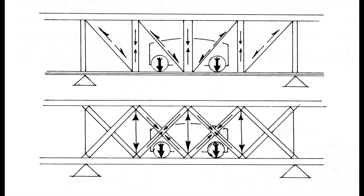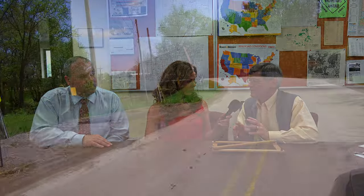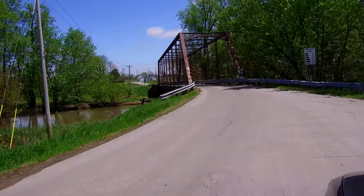Any truss has two types of forces that act on it: forces that are pushed together, said to be in compression, and forces that pull apart, said to be in tension. In a drawing you can actually understand what components work in a truss. The arrangement of the tension members and the compression members is what defines a particular type of truss. In an iron truss, the compression members are going to be very heavy and built up, and the tension members are going to be much slender and thinner.